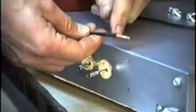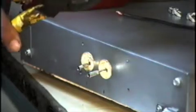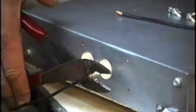I've stripped one end longer than the other so that I can fold this over. I'm just going to tighten it down with the pliers. That way I can get twice as much wire inside the end of the crimp. I don't think it's entirely necessary, but I like to do it just to ensure more of a contact area when the barrel crimp has been collapsed.